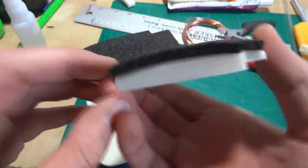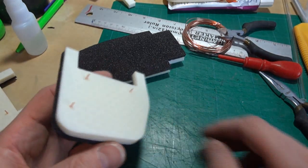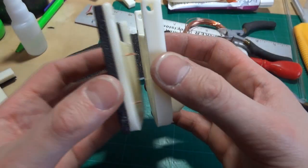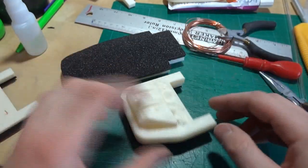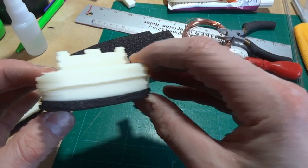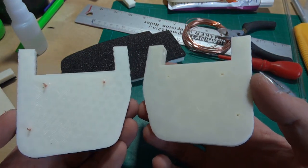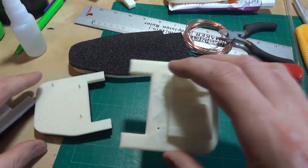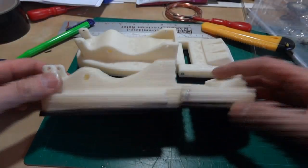I've got some thin wire which we'll use just to key those together, and we can stick the two surfaces together — that will give us our feet with compliant soles. I've glued foam onto the bottom of all these pieces, which are the very slightly curved soles. I've also put bits of wire into the pilot holes so that I can stick those straight onto the toe. If I line those up correctly — yeah, there we go — so there's the profile of the foot. I just need to glue those together with a light bit of super glue just to fix where the pegs are, and that's so if I need to get them apart I can.